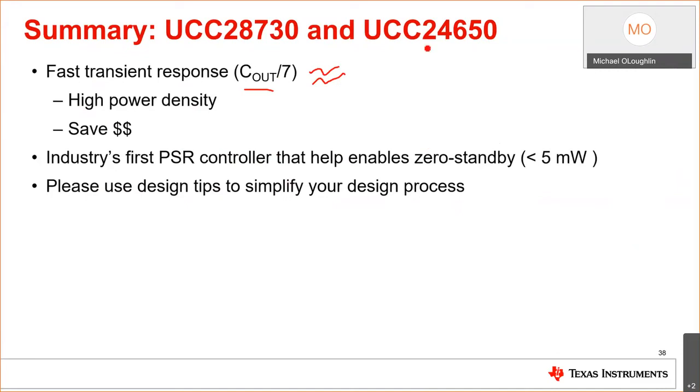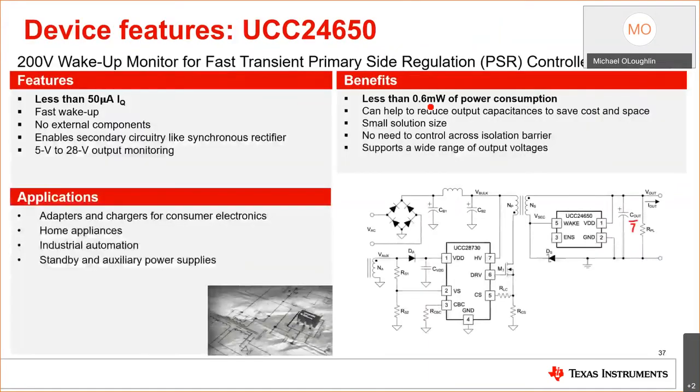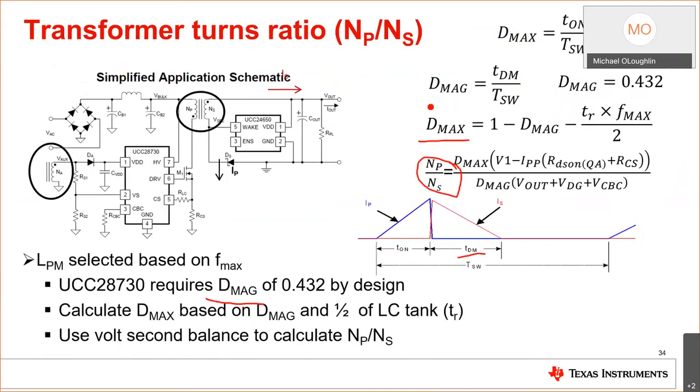Yeah, Mike, one of the questions that just came across was: design for max frequency, not the min. Isn't it the opposite? Can you clarify? No, yeah, you have to design it for max frequency and not min. It's the control law. The control law actually ends up operating differently than you would think.